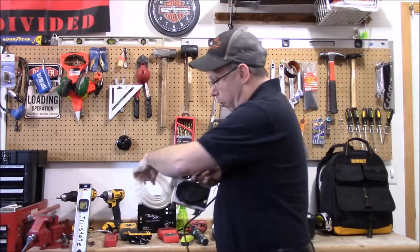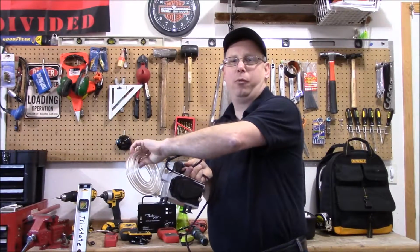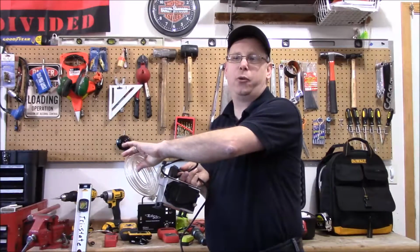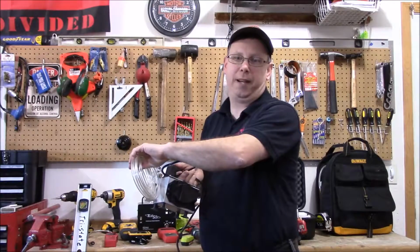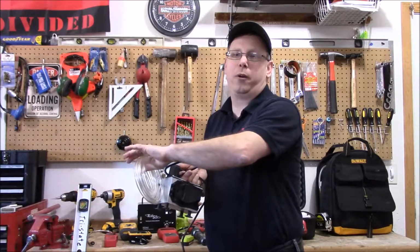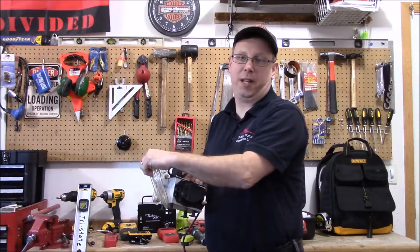I also perform mold inspection. This here is a pump. This pump gets set up. I will pump 150 liters of air through a canister. It gets mailed off to a certified mold lab to analyze, to tell us exactly whether there's mold in your house, what kind of mold it is, and what the concentration is.